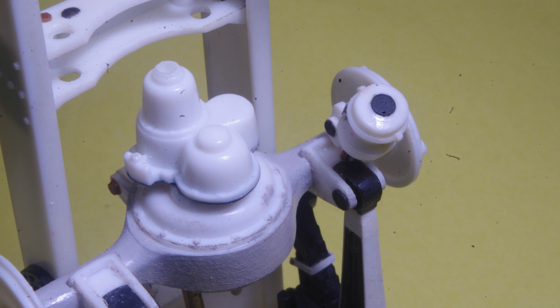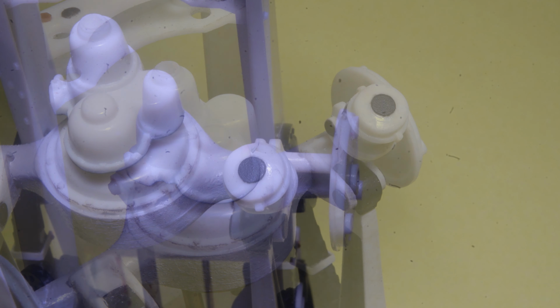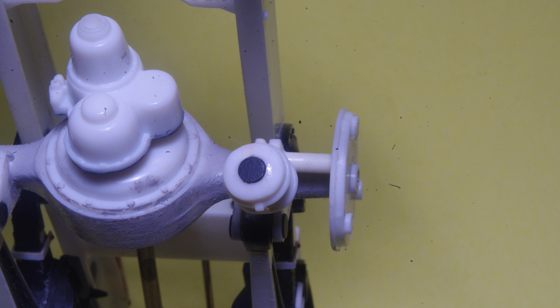Here is the brake chamber glued in place, and now there's only one more detail to be added to complete the installation, and that is a piece of 3/32 styrene tube cut to fit and glued in place between the brake backing plate and the brake chamber mounting bracket. This represents the torque tube through which a shaft runs, transferring motion from the push rod and slack adjuster to the brake shoes.